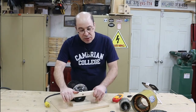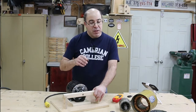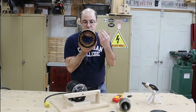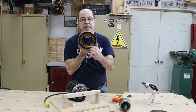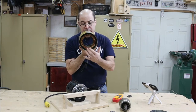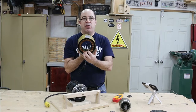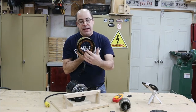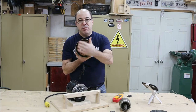What we know is: if you immobilize the shaft of a motor that depends on induction to operate, you're going to see tremendous amounts of current flowing into the machine. Excessive current flow produces huge amounts of heat, and manufacturers apply only a thin coating of varnish covering the conductors. When that varnish is exposed to heat it bakes and crystallizes, and that's where we start seeing short circuiting. You no longer have resistance in the motor — you've got excessive current — and the windings basically get cooked. The wire itself isn't damaged, but the insulation is, and it's the insulation that allows the motor to function properly.